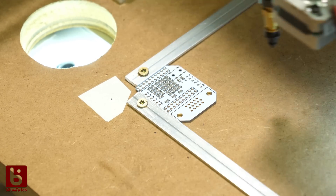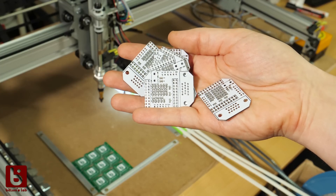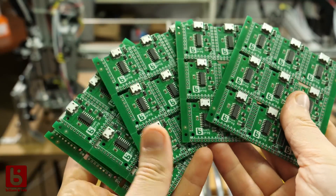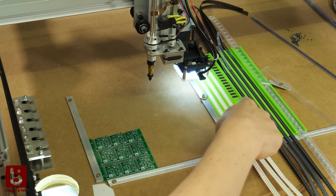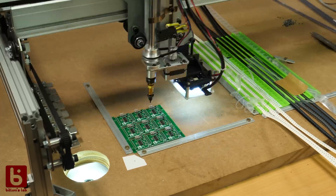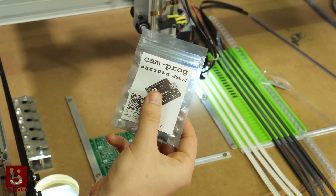Last Sunday, as you've probably seen, I finally managed to configure the machine to pick-and-place a simple board like this here. That helped me a lot to get familiar with the software, and I was able just within days to configure it to pick-and-place complete panels with several different sized components. With each panel I improved the settings so I was able to do other stuff while the machine was working. Just within one week the machine was running and I was even able to ship the first boards.